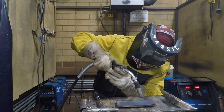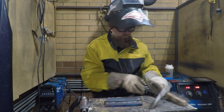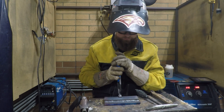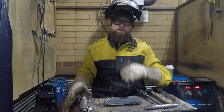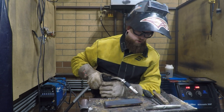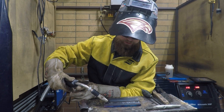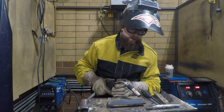There's your lap joint — leaving the edge exposed, nice and consistent. If I'm going to do a second or third pass, I always start at the bottom and work my way to the top. We'll do this in a T-joint too, but it's also fun to do it in a lap joint. When I'm welding this second pass, I'm not going to put my wire right on the toe. I'm going to put my wire slightly up on the inside face of the weld, and again hold about a 40-degree angle as I weld along that toe.